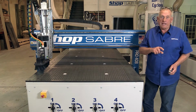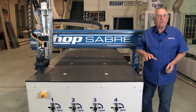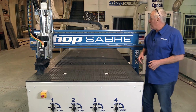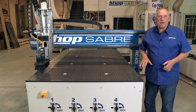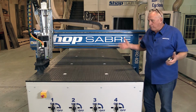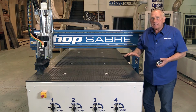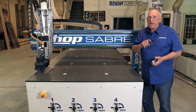Well, the benefit of that is I can take a 4x8 machine and cut those 5-foot by 5-foot pieces of Baltic birch that you make drawers out of so often. So I don't have to buy a larger machine just to do that. Now, typically these machines would be used on nested base manufacturing, and you use a technology called flow-through, and basically we pull vacuum through an MDF panel, and that holds the parts. And the design of the vacuum system is really, really important, or the small parts move around on you. Let me tell you how we did it.